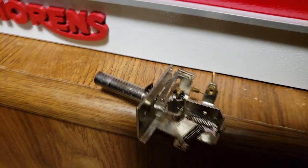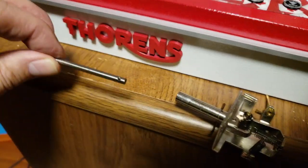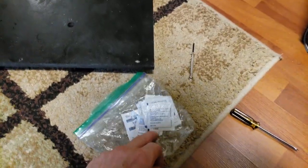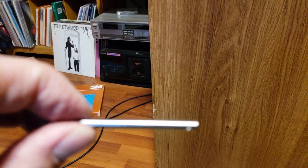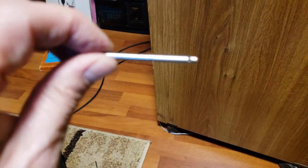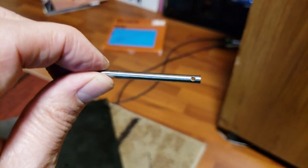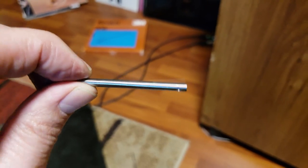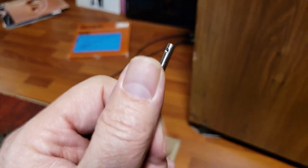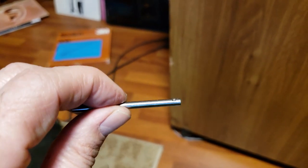So what I ended up doing is I did release that screw, which you can see there. It turns out that's actually screwed into the post that goes in here. So now what I'm going to do is take one of these — my wife's a nurse, so she has all these alcohol swabs. So what I'm going to do is swab that right out. And you can actually see, there you go, where it screws in. So you can feel this is kind of all jammy, gummy kind of feeling and it's dry. So it does need lubrication and that's probably why it hasn't been lowering quite as quickly as it should be.